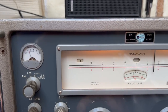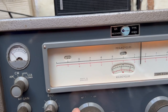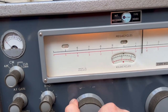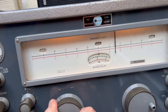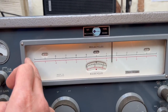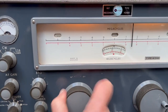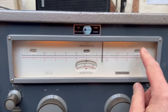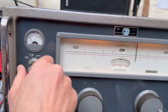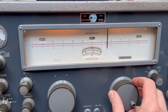Anyway, the aerial is really designed for 40 meters, so I'm going to go up there and see what happens when I tune up. So 1.5, 3.5, 4.5, 5.5 — it reads backwards on some bands and forwards on others. 4.5, 5.5, 6.5 — so 6.5 to 7.5 and we're in the 40 meter band. Now bear in mind we're on SSB, so let's put it on SSB.